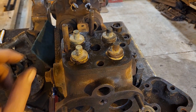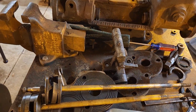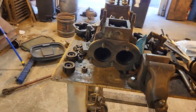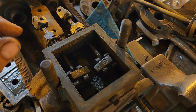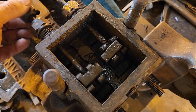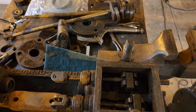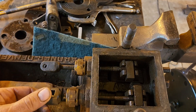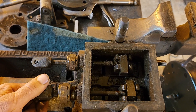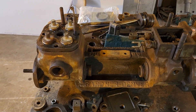With a little lapping I can get these all lapped in, springs from McMaster-Carr - not a big deal. I just picked up a hone - we'll hone these out. Assuming I can get rings made, I'll get the water side together. The steam side is easier: just hone it out, clean everything up, put the new rings on, put it back together. There are the little slide valves up there. Once it's all together, do the adjustments to get the valves timed - and unlike locomotive 58, this is very easy to time. These pumps have nice little screws - you just turn one a bit and it moves the valve. Simple.